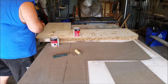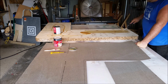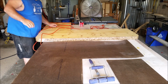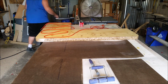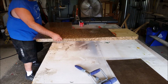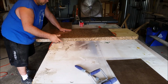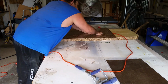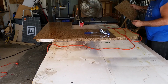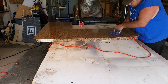Once I had everything cut out, I just used some Weldwood contact cement, covered both surfaces really well, and let it dry to the touch. After that was done, I used my extension cord. This is a tip I got from a subscriber to kind of keep everything separated. So when I put the laminate on, the 2 glues wouldn't contact until I had it right where I wanted it to. Once I had the position right, I just pulled the extension cord out and pushed everything into place. Really cool tip, and I'll be doing that from now on rather than using PEX tubing. Again, I repeated that on the piece I had to add on there, and once that was done, I rolled it all out.